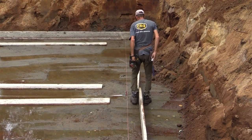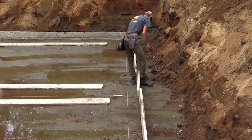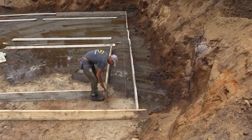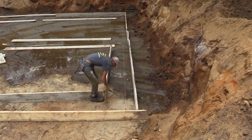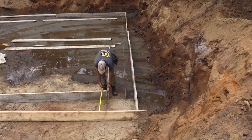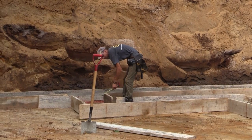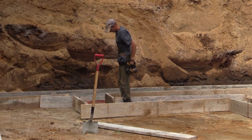When necessary, in certain areas, you may overlap the formwork planks. Since the footing will be buried, it is not mandatory that you spend time on aesthetics or on impeccable finish. However, it is to be noted that aesthetics may have a certain importance for certain types of constructions. Continue the installation of the planks while checking that you have the right measures. You must also set up footing for steel posts, fireplaces, chimneys or others, as indicated on your plan.